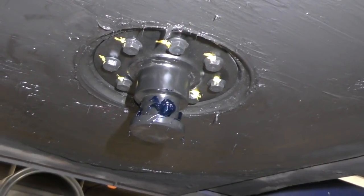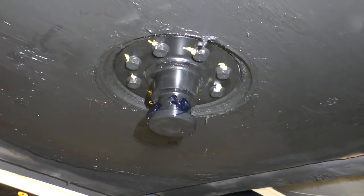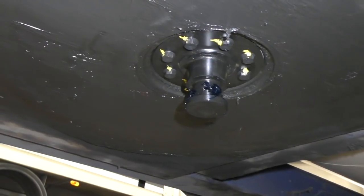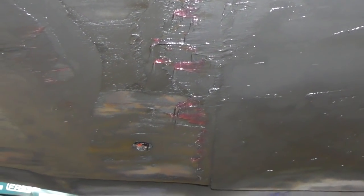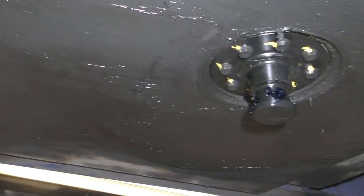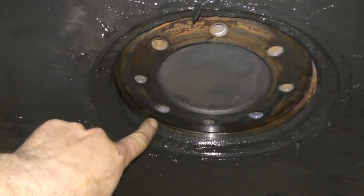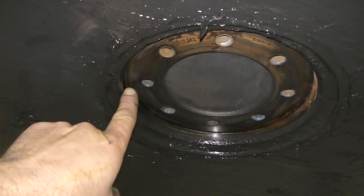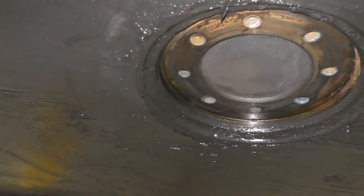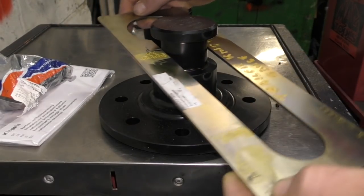Now, this is a kingpin and kingpins are what attach the truck to the trailer. We also have a sledge plate. This is a greased part which spins on the fifth wheel. This is a sledge plate where the run-up ramps go - it only seems to be in Britain that we use run-up ramps. Those eight bolts are only holding the kingpin in; it's the edge here that takes the stress. You can imagine you've got a fair weight on this trailer, and basically it's this kingpin that does it.